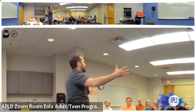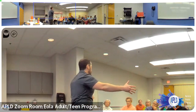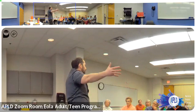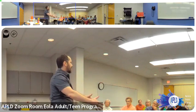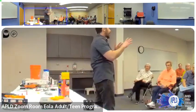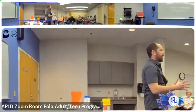By the way, don't cover your condenser, the outdoor unit for your air conditioner, in the winter. There's no reason for that. The people that sell those covers, it's a scam, right? All that does is make a nice little place for rats to hide the winter through, okay? And they will mess it up. This thing was built to live outdoors, let it be happy.